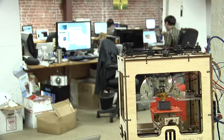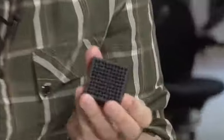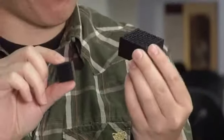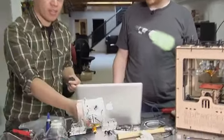Printing was a moderate success. It doesn't look like a cube — it's a kind of rectangular, oblong, squarish object. We ran out of plastic, but the resolution does seem very good. There are definitely some kinks to work out — the temperature needs adjusting. Our new thermistor seems to be registering a little cooler than actual, which means the temperature is a little higher than it seems to us, making it a little goopy. We'll dial it in more. But the build is a success — we built the Plastruder MK5, put it on our MakerBot, and made our MakerBot a better MakerBot.